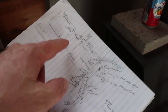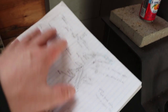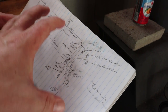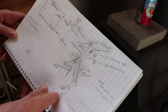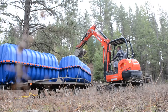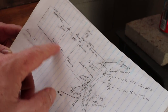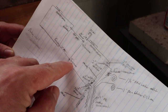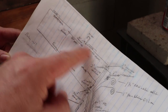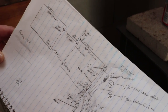To help us understand the components that we needed, we drew this really rough upper schematic. This is the upper part of our plumbing system. It doesn't represent the whole system because it's really split into two major components with nothing but pipe connecting the two. We started out with one tank and as a consequence of some other things we ended up with two. So we're actually going to create a series system — connecting two tanks at the bottom through a couple of bulkheads and at the top through bulkheads too. This will allow air to pass between the two, and this one will allow water, so we effectively end up with a tank twice as big.